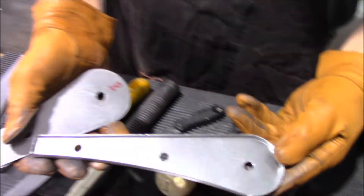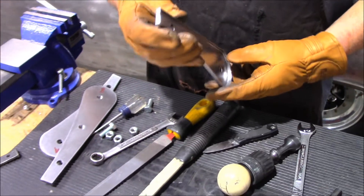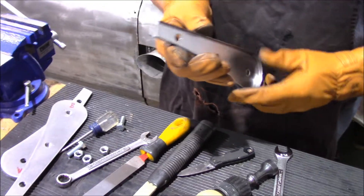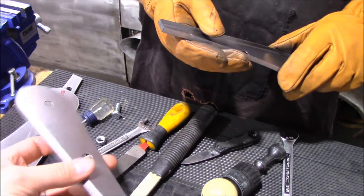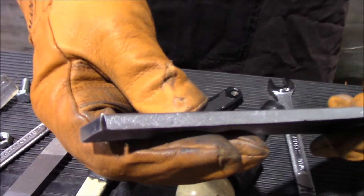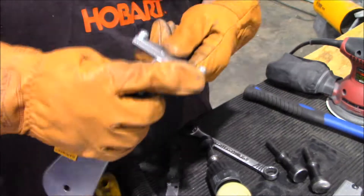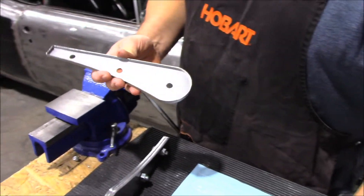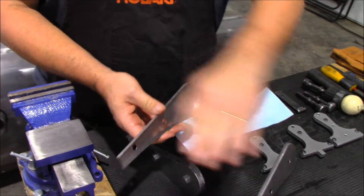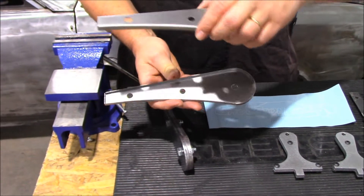As you can see, it's really taut. It looks like a piece that's been pressed, and I'll be impressed — the thing turned out nice. Both pieces are identical. You can do a lot of different things with this. If you look at the corner here and see the gap we've got — we had to do that to be able to get the die out of it, and that's where these tools come in handy. A simple example of what can be done is you can make an oil catch can — like this, with the metal wrapped around. End up TIG welding it together and you'd have a great-looking tank with these pieces.